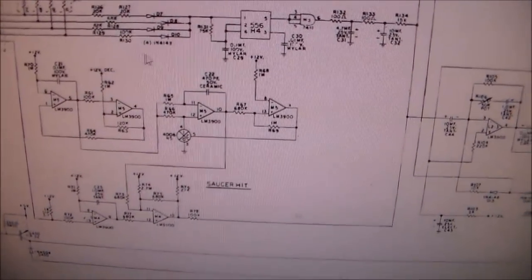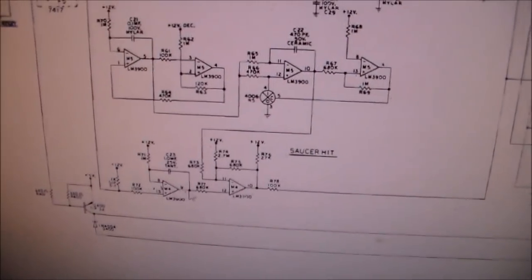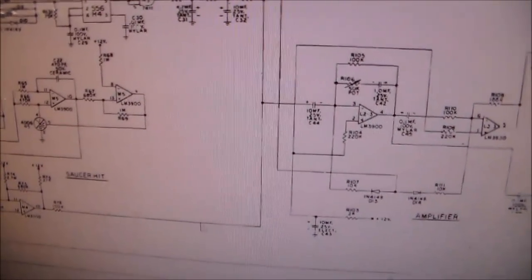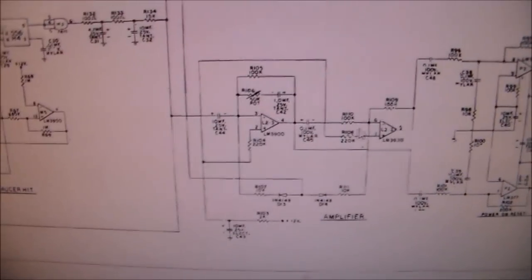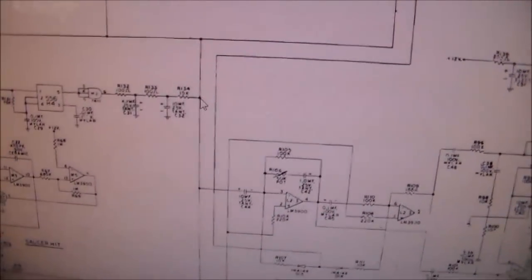Of course, all that's working. But if you look, those aren't actually connected. The only thing is it runs through here. So it signals it. This chip and this chip together create the sound and trigger it. And then the sound comes out through here, connects over to here, like all the other sounds, and runs through the final preamp and the amplifier. So like the thump, thump, thump connects here.